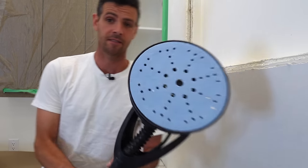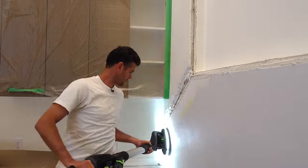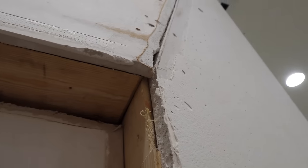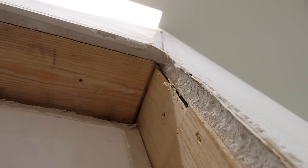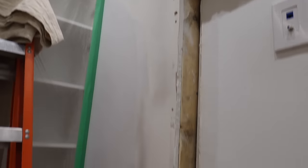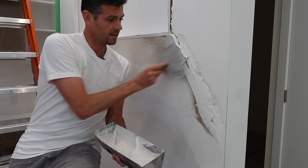I didn't bring any of my hanging tools. This is pretty much what the Festool Planex and 40-grit sandpaper was made for. That actually wasn't so bad. I also ripped off the drywall from the inside perimeter because it was so built up — figured once I put some fresh stuff on it'll be a better start. But I actually left a lot of it on because it planes out better. When you look at the framing, you can see it's like a quarter inch at a level, so the joint is nowhere near where it's supposed to be. It's actually planed down now to be in more or less the right spot.